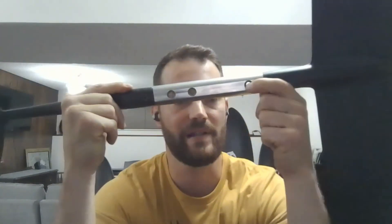So working down from there, the front wing is mounted to that. The other piece attaches to the tail with just two screws — they're hard to see because they're black, but they're just M6 hardware. Our foil uses M6 for everything. There are three M6 bolts that basically suck the mast foot into the fuselage. These two are kind of like a scarf joint from carpentry, and then we've got the standard 30-millimeter spacing M6 for the tail.